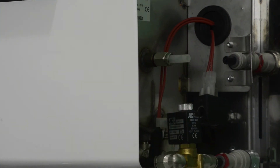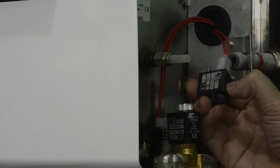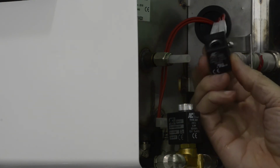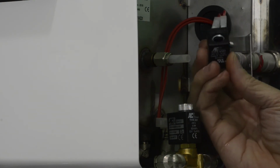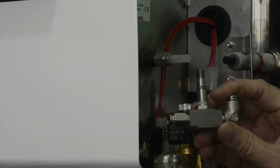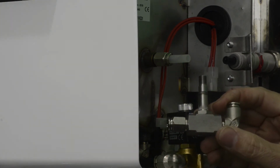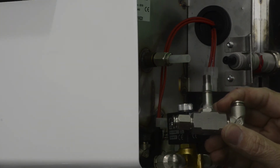Please make sure that your humidifier is turned off, and this is not potentially getting energized, because a coil that is energized that we don't have a stem on, we have potential of burning this up. So make sure your humidifier is completely shut off. At that point, we have a loose humidifier fill valve that we're going to take over on the table, spin off this stem, and I'll show you what we do to clean that out and get it put back in.